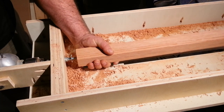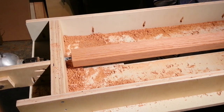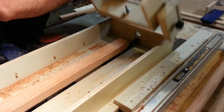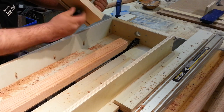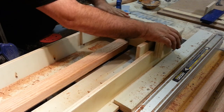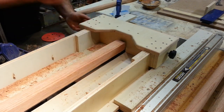To mount this thing I just turn the drill on in the forward position, and that holds it on. As you can see, that thing is just sitting there in midair — floating there — and it holds it really quite nicely. On the other side I've built a sled of sorts, a removable sled so I can do different depths. I've got a little 5/16 bolt that goes in, and once I have it in position I tighten those two bolts down on either side. I just slide that into the hole on the other side and tighten everything down.